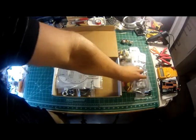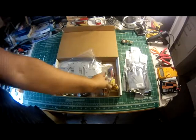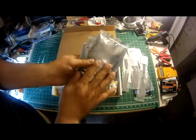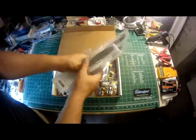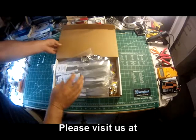And then the ARF kit: you get the wiring harness, you get the four 2212, 1000 kV motors, you get the four electronic speed controllers, and the six propellers — two spares, two counterclockwise, two clockwise. That's the ARF kit.